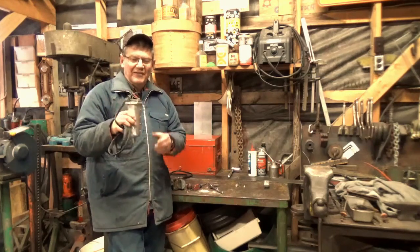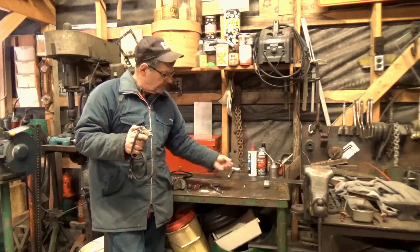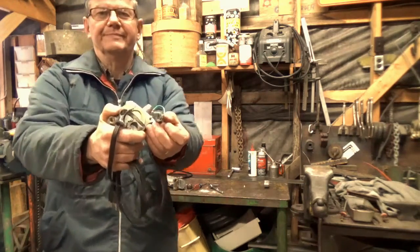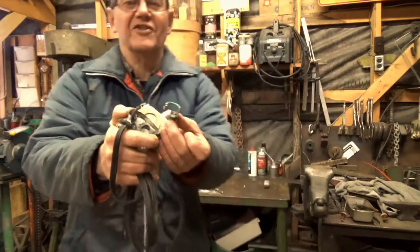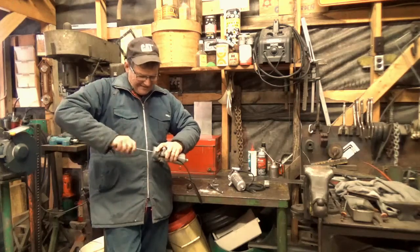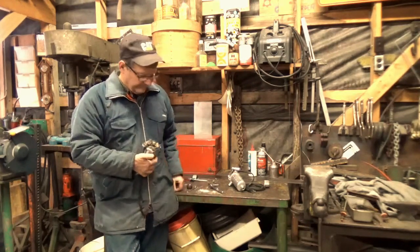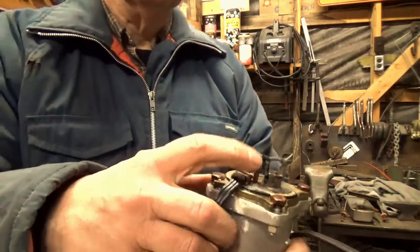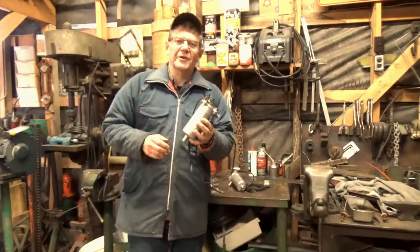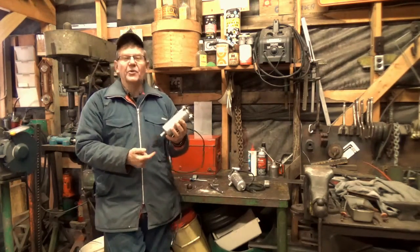This isn't the block heater I took off the tractor — this is one I've had sitting on the workbench that I thought I might be able to fix. I pulled it apart to see why it had failed, and the thermostat opens at about 156 and closes at 190 degrees Fahrenheit. As you can see, it's overheated, melted, and burnt the connections. This is the one I just took off the tractor — let's take it apart and see if it's had the same failure. Let's do a failure diagnosis. Lo and behold, exactly the same failure. I'm confident it's because this unit, like all the other units I've purchased that have failed, was 1500 watts — just too many BTUs for this poor little heater to withstand with a very limited coolant flow coming in and out.